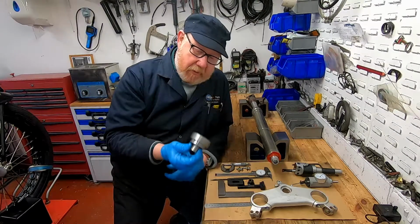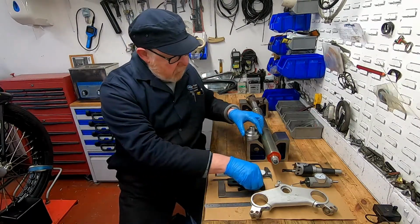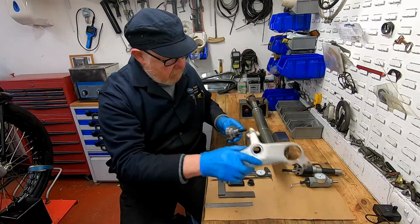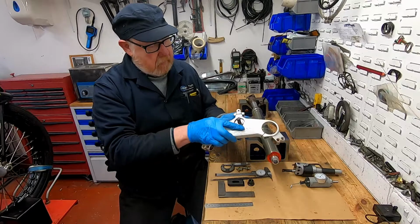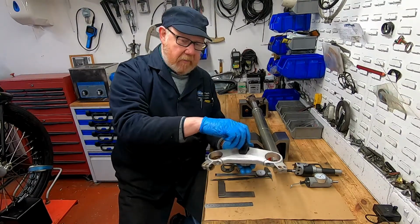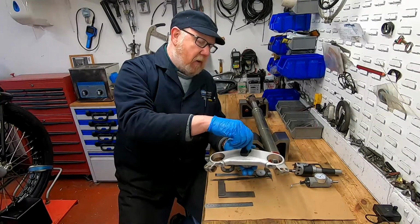The problem is, of course, that that sits onto the table of the milling machine, and our T-slot bolt will go through here, as you can see there. Then our casting will locate on here, and then the clamp goes on, and then the nut screws down on the very, very simple clamping mechanism. No problems there.